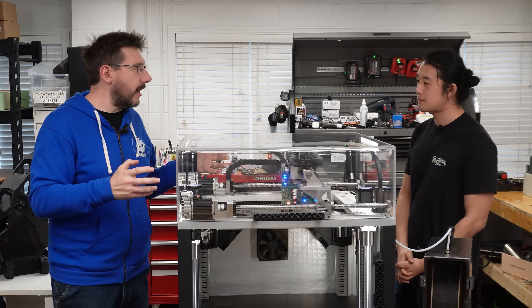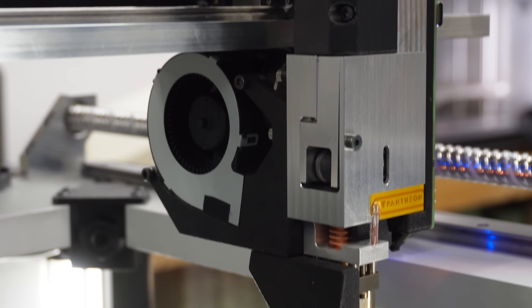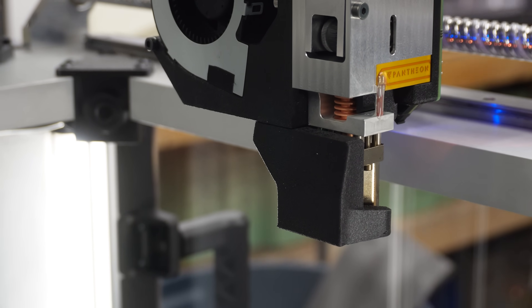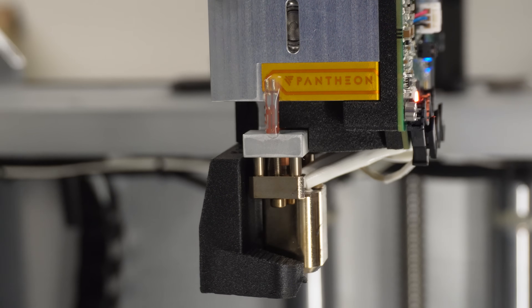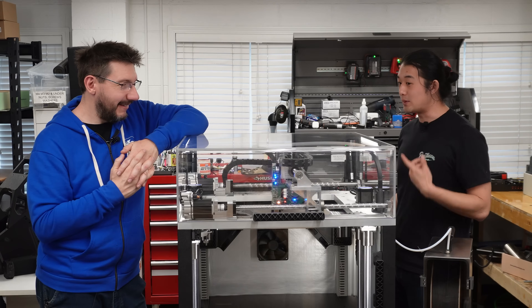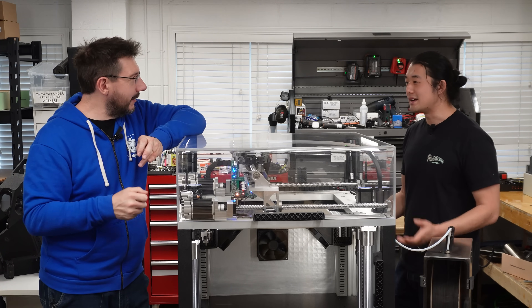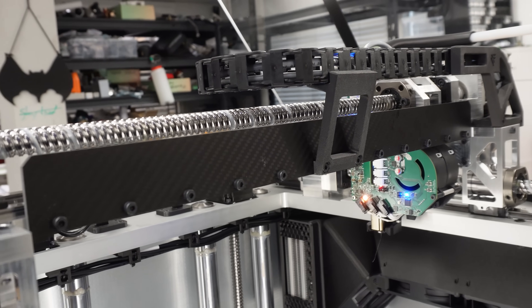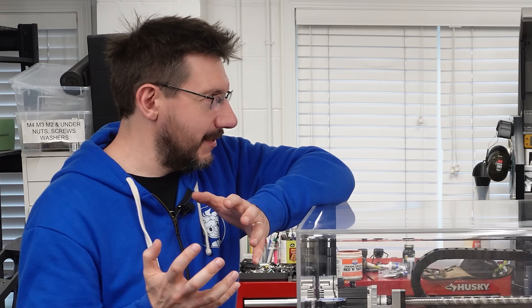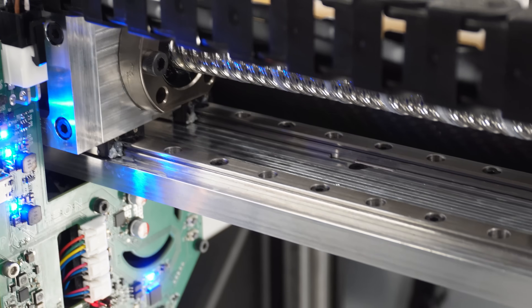Speaking to the product aspect — whether it's a robot or a human on a farm of machines, being able to just take something off, bolt it on, and have profiles good to go is way more serviceable than having to torque a piece off and on. Pretty much every layer of your extruder stack — the nozzle, the hot end, the extruder itself — can all be swapped in about a minute. We went to bigger bolts where we could because small bolts are frustrating. The smallest bolt on here is an M3.